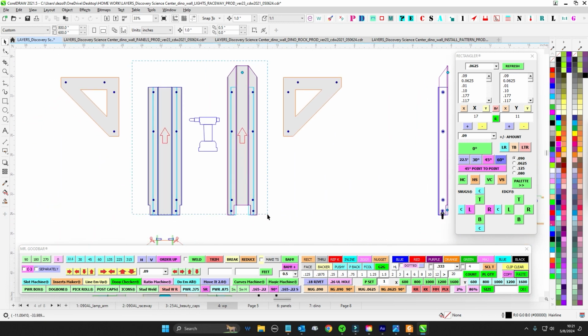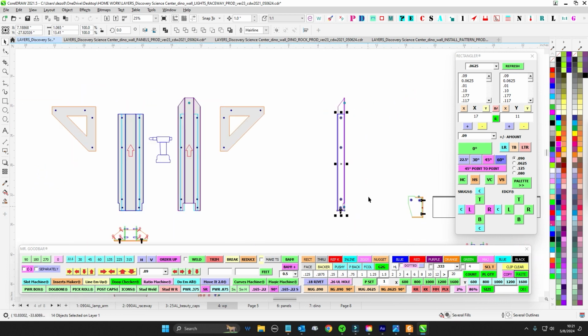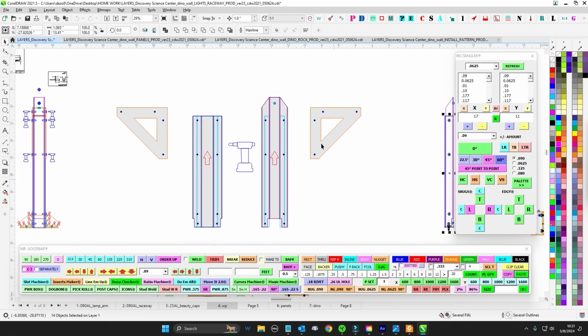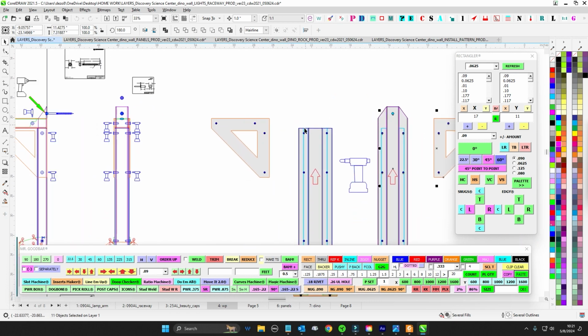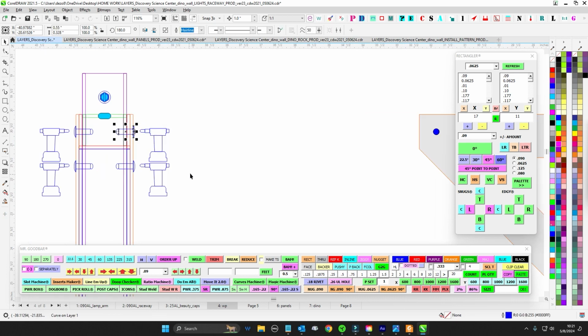It's a 2-piece design. This is permanently together in the front here. The bigger one goes to the front. The mount closure on the back side goes to the back. You're going to use these braces to bring everything together, and you're going to sandwich together the brace and all of these three. So make sure you have rivets that are long enough to go through everything.